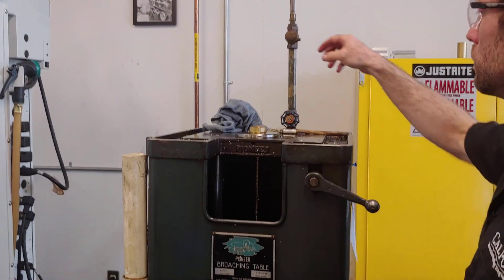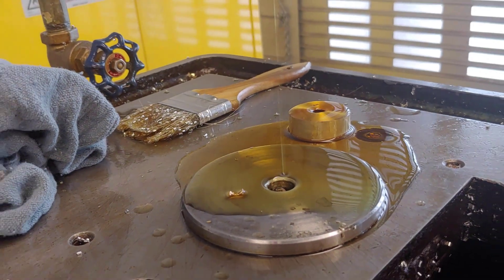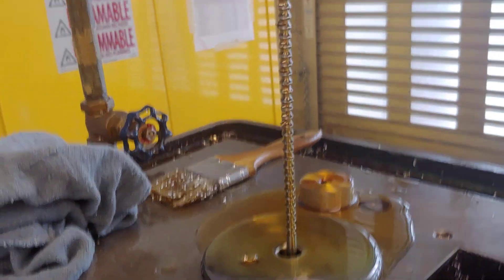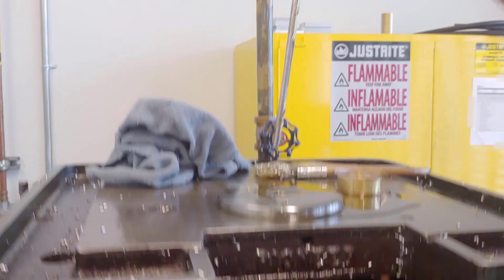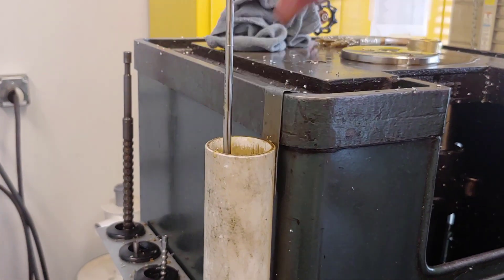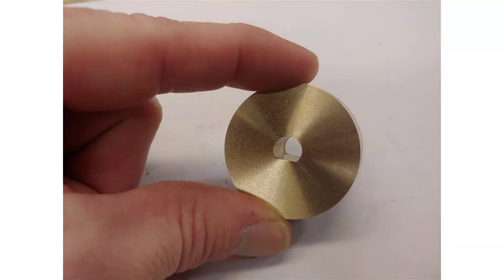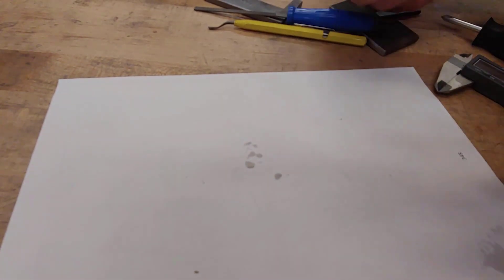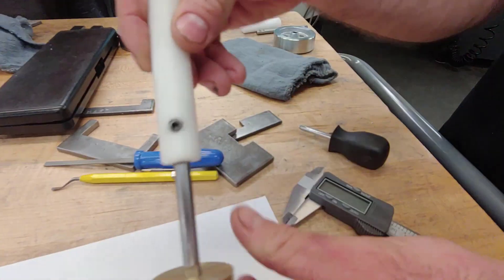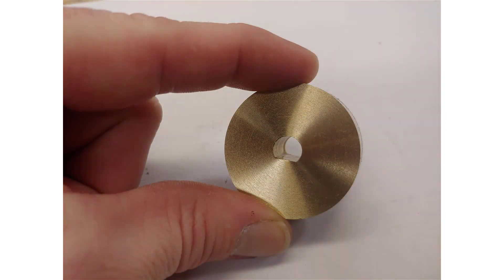You have to be careful — remove your workpiece before you send the broach back up, or it's going to send the workpiece flying when the broach returns to its position. When you're done broaching, take the broach out and clean it so it doesn't have any chips. We now have a D-shaped hole with sharp internal corners created in the part — broaching will create that sharp internal corner. Before we're done, we check the part with the go/no-go gauge to make sure we have the right D-shaped size broached in our part.